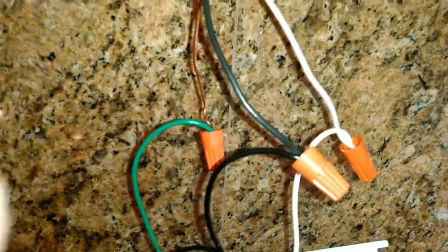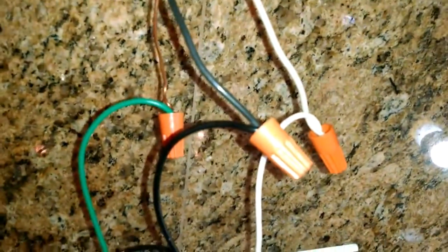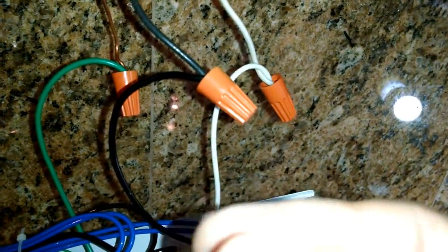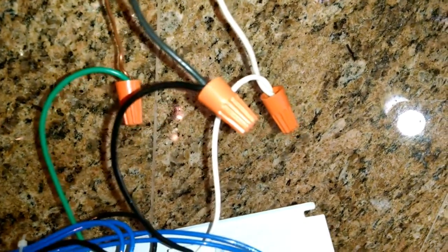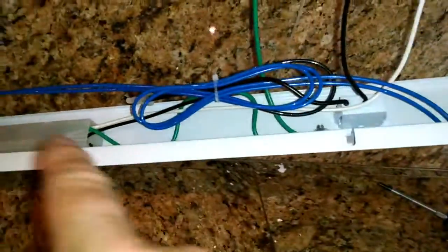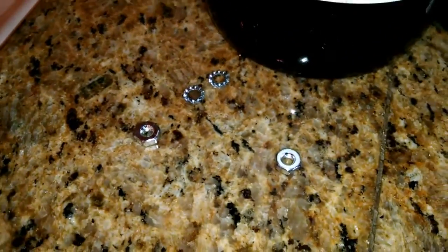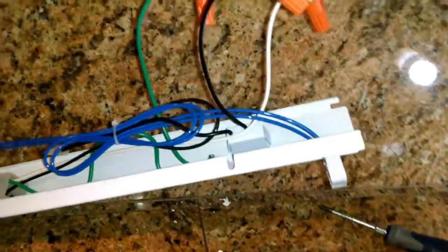There are all your wires connected — these are called wire nuts, in case I didn't mention that before. You just put the two wires together, strip enough insulation so that there's bare wire to connect to bare wire, and then just twist them on pretty good and tight. Now you're going to shove all those wires into this little trough or tray, and then attach those nuts and lock washers so that it's all bundled up together.